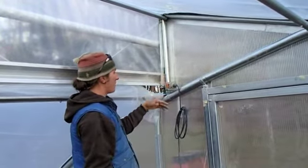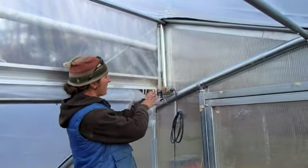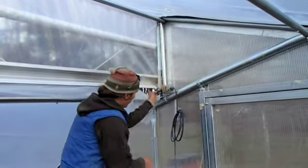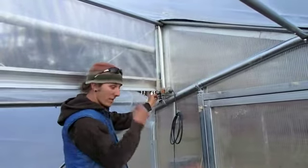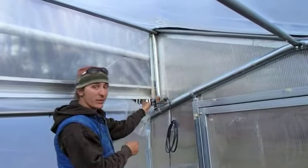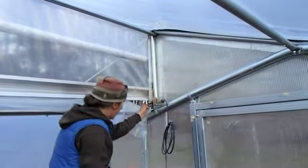For our setup, it made more sense to put it inside, and we put it in a place where it won't function any differently. You want this extension to go almost to the end, maybe 1/16 from the edge of the roll lock. You don't want it to stick out beyond, because then it will trigger on its way down before it curves back up into the roll lock. And so you want it to extend out there.